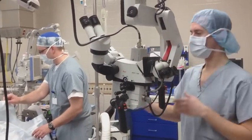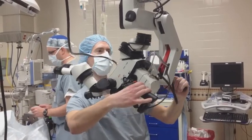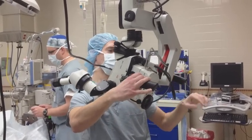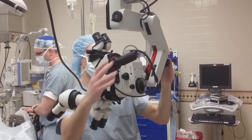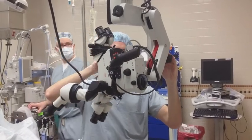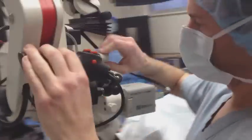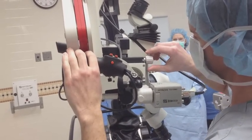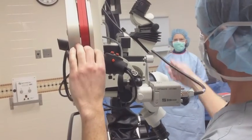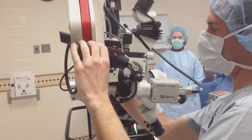Same procedure for the B. You'll just have to rotate the scope head so that the line of sight is perpendicular to the floor. As you can see, it's kind of falling this way, so we're just going to turn this out. And that basically holds it in position — now you've got that balanced as well.